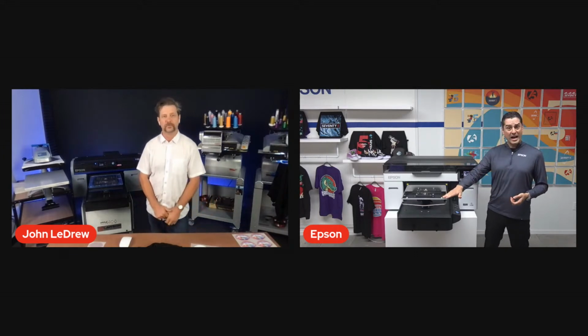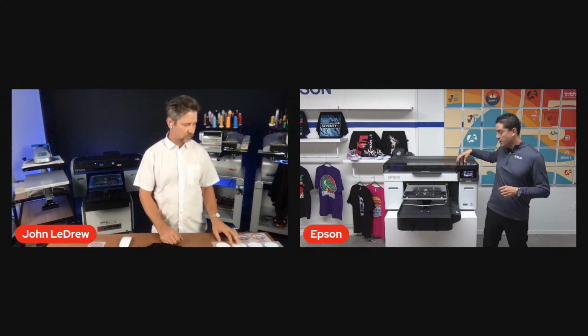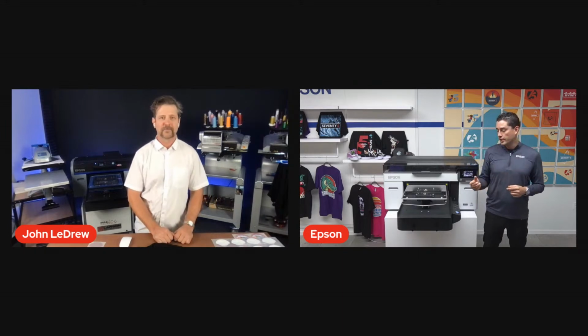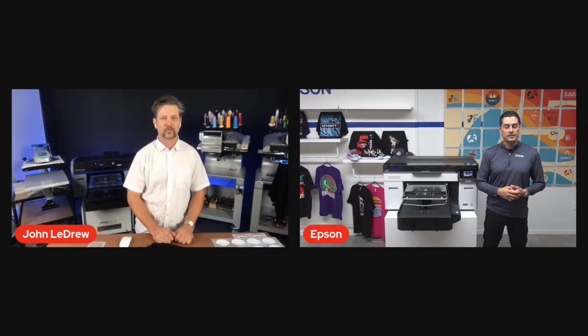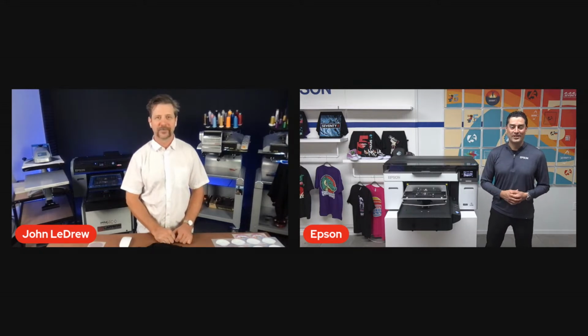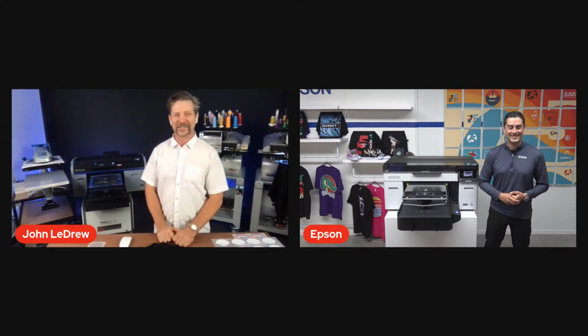Right. Oh, well said. So the highest point on the platen, those print heads inside the carriage underneath the covers will actually adjust to the appropriate platen gap. So regardless of if it's a shirt or a piece of digital transfer film, you're always going to get the highest resolution and detail. Nice. Autofocus. You mind if I use that in the future? Absolutely. That's a good one. I'm not going to claim it as my own. I'll give you credit, but I certainly do plan on using it.